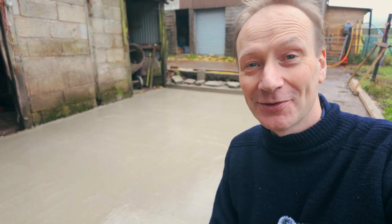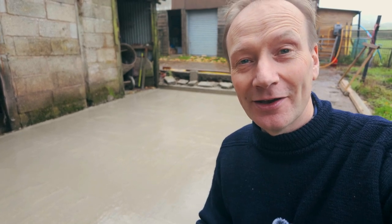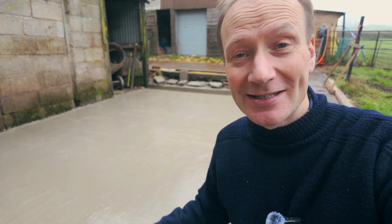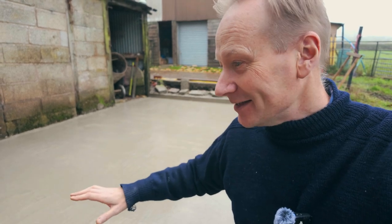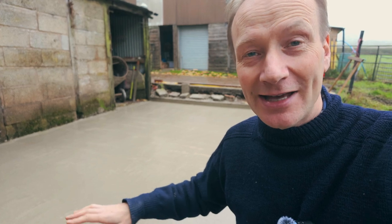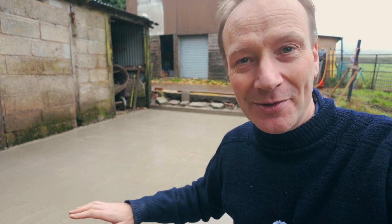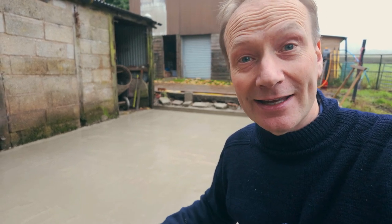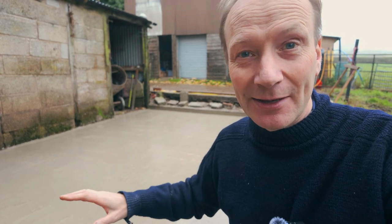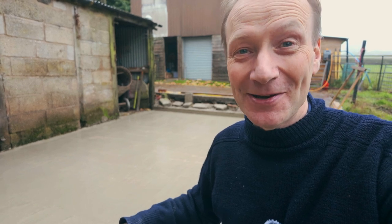Well that was quite a lot of fun actually, and it went better than I thought it was going to. That little dumper truck thing that we were using was superb. Along with the tractor it took us about 40 minutes to unload about two cubic meters of concrete, which is about five tons altogether, and with the three of us doing it it didn't take too long. This is the finished — more or less the finished product. We've got a nice pad that I've rippled down. It's not going to be a really ultra smooth surface because the sheep are going to go on here eventually and I don't want them to slip. So a slightly textured rough surface is probably the best finish we can hope for. We're just going to leave this — it's only about 14 degrees at the moment so it's going to take a little bit of time to harden off. Because the weather's a bit rubbish we're just going to cover it with some damp proof membrane, which is like a thick plastic, so if it does spit with rain we're not going to get little puddles and raindrops forming in it. So yeah, I'm quite pleased with it really.